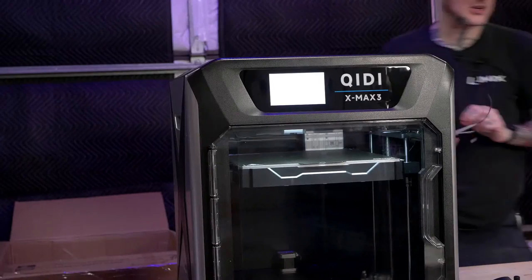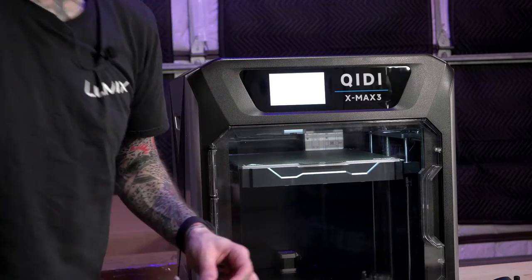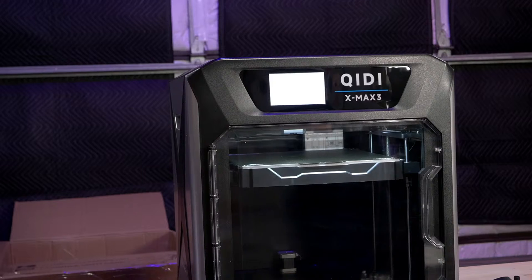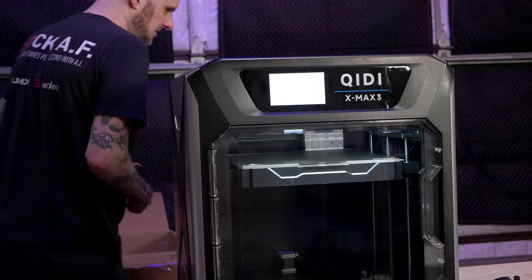I'm gonna go grab a wrench to take this nozzle out of here quick. Screen is still updating. It is at 13%. Whoop-de-doo. At least it's a very slow process. Okay, 6mm wrench? No. 7mm wrench? Yes. And the wrench to support the heater block, 15mm. 7mm or 15mm wrench, so we can take the nozzle out.